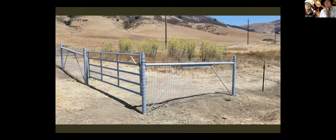There's a question about how the fences hold up going through stock ponds — that's probably referring to corrosion. It's going to be about as good as the galvanize. If you have the hot-dip galvanize it'll obviously last longer than something that's uncoated or even painted. Running anything through water that sits there all year round is always a tough one — eventually it'll probably rust away.